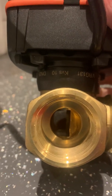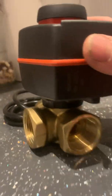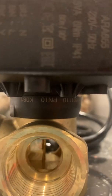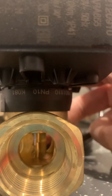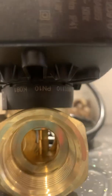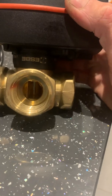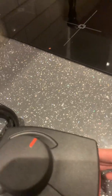The flow still has priority — a larger bore — and the return has a small bore, and then it's going to the heating circuit at a mix. Now it's getting really hot outside, so the boiler's saying we don't need a lot of flow, so we're just closing down the flow from the boiler — small orifice. To keep the flow to the heating circuit quite cool, the return has got a large orifice, and then the mixer's moving over. That's all it does.